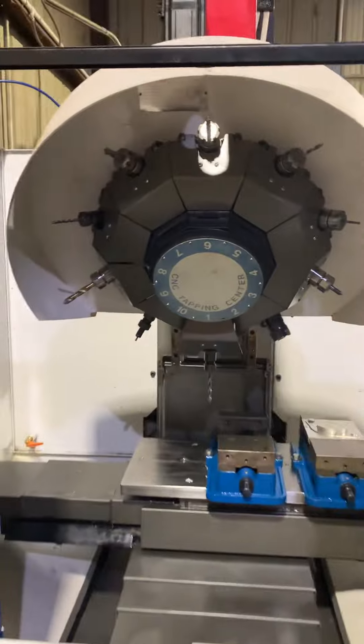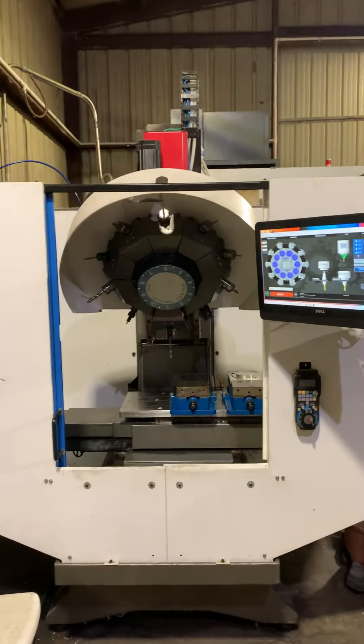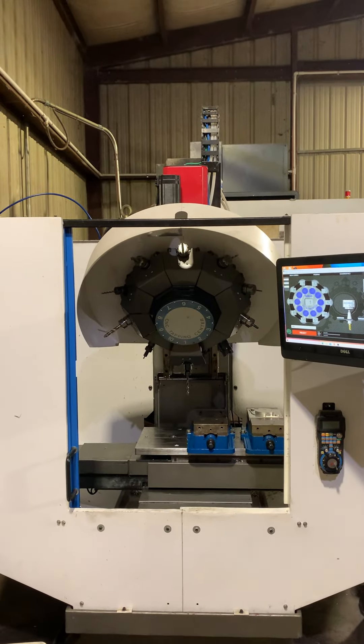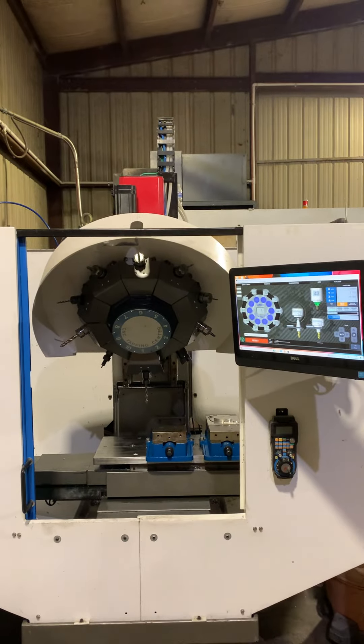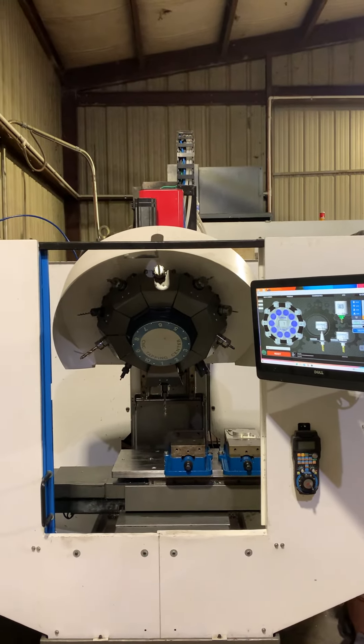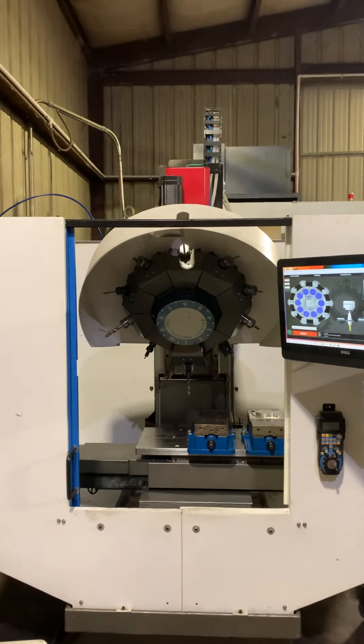We're in position one, let's go to number two. So you see this — it's a bit faster than what it was. I'm happy with it. My closed-loop stepper is not overloading anymore at that speed, and I've got all my tools on the carousel now.